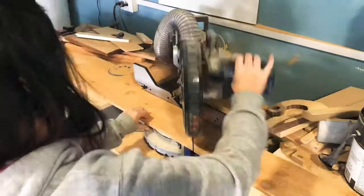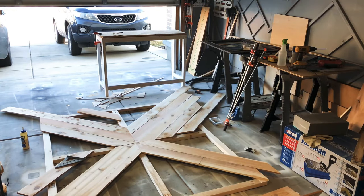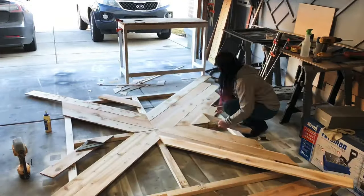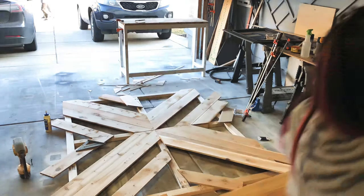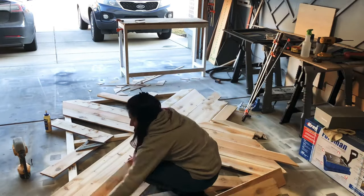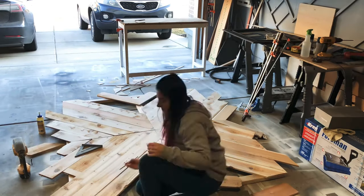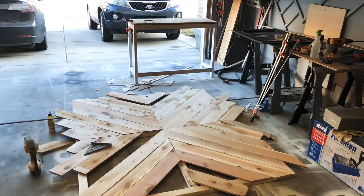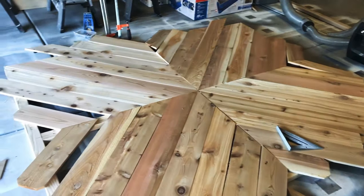Now they're ready to cut. Move your saw to a 45-degree angle and begin the cutting process. I usually lay my first 45 down and try to get that centered — the top V and bottom V centered on the middle board — and then cut your pieces from there. Don't worry about the outer edge of the door right now. You can go around that with a circular saw later so you won't have to cut those pieces down at this point. That's one of the things I love about this mosaic pattern: as long as you have a 45-degree cut in the middle, you don't have to worry about the outer edge. It looks more complicated than it actually is.